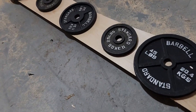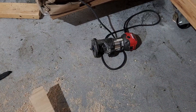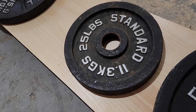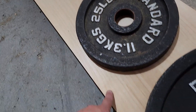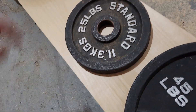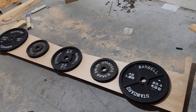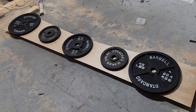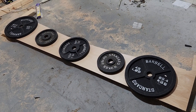Next on the agenda for this is I'm going to grab our little router right there with the bearing — you can see the offset bearing. Stick her on the edge and then cut her out. Take that right against the side, run it all the way until you hit there, and then it'll get a perfect cut finish so the skin will match absolutely perfectly. That's what's going on with the spar. As soon as that's done, we're just waiting on the fuselage, and I'll go into the garage and show you where we're at with that next.